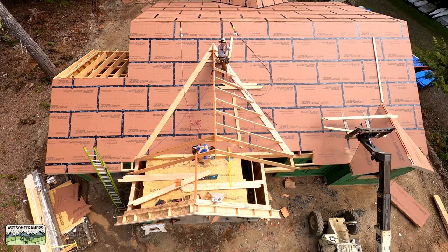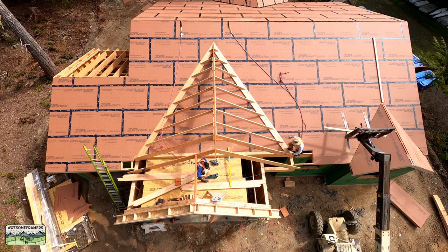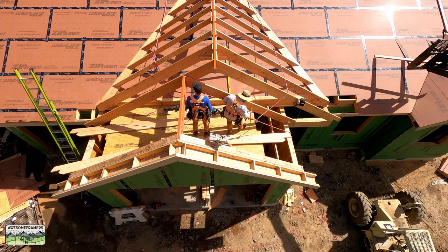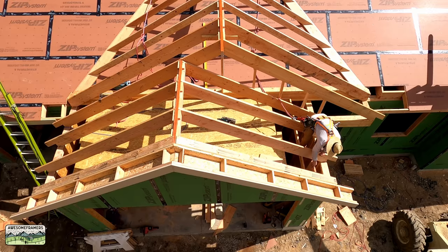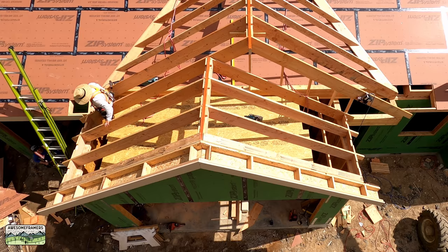A couple were just a little off — that's what happens. If you don't get those level cuts just right, sometimes when they're long they don't want to land on layout. We eyeball that LVL ridge to keep it straight. I don't get too worried about overloading one side of the ridge with just 2x6 California jacks — that just doesn't realistically happen. After lunch we finished the lower 7/12 section, set rafters, blocked, then I framed in the gable end while Kyle finished rafters on the left side. Bird block time and we were done for the day.